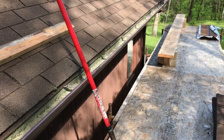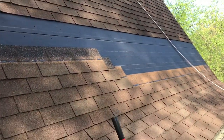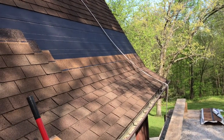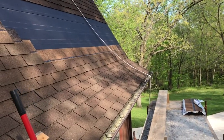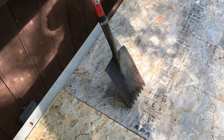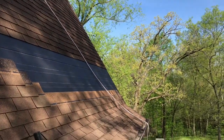There aren't a whole lot of different ways to strip a roof, but I've settled on one that works for me. I'm doing this myself — one guy — and it'll probably take a couple of weeks working around the weather. Whatever I tear off in a day I've got to have buttoned up weather-tight before the next rainstorm. In Iowa in the springtime you don't gamble with that. Here's a shingle spade — it works great for ripping shingles off a roof. The warmer the roof is, the better it works; in cold weather it shatters the shingles into a lot of little pieces.